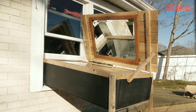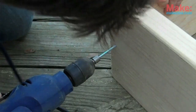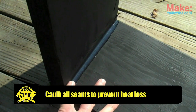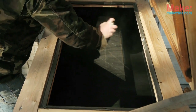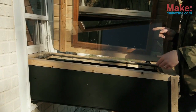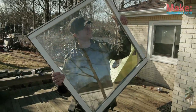As for how we built this, it's really simple. I took four big old wide planks — I wanted a deep collector — built those into a rectangle with screws, slapped down a piece of plywood on the bottom, and painted the whole interior black. You want to use flat black paint; glossy black paint actually reflects some of the heat, so you'll lose heat. You lay a pane of glass on top — you can use one store-bought, you can use plexiglass, or something you find street-side for free.